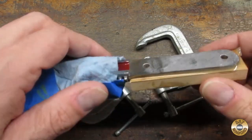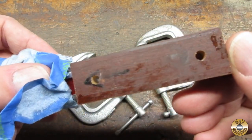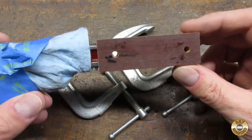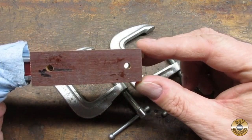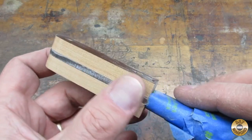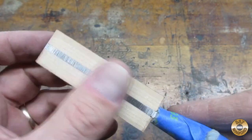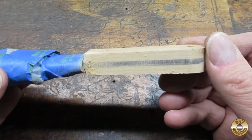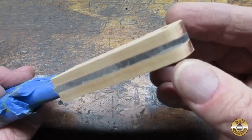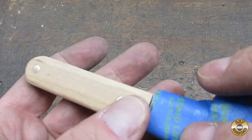I had to reassemble the wrench before adding the wood scales. I drilled two holes for 3/16th diameter pins, then epoxied one scale in place and drilled through the wood. Then I epoxied the other scale and drilled through again. I used my 1x30 belt sander with the same aggressive 40-grit Harbor Freight belt to rough out the shape of the scales. Before gluing in the pins, I also roughly sanded down the thickness of the scales. Here's the handle with the pins installed and roughly sanded to shape.